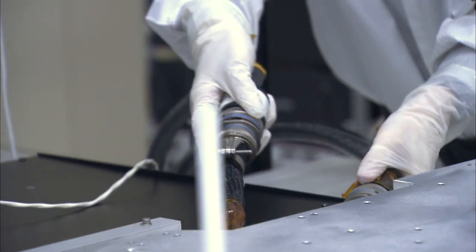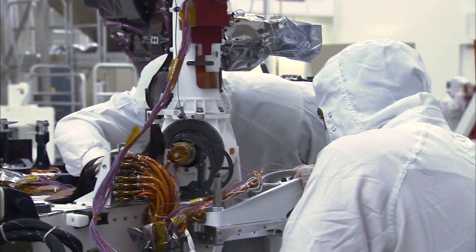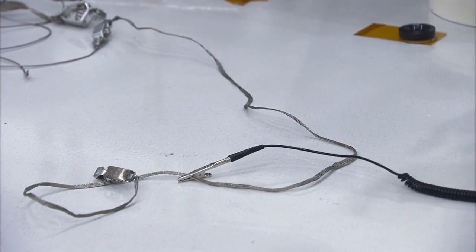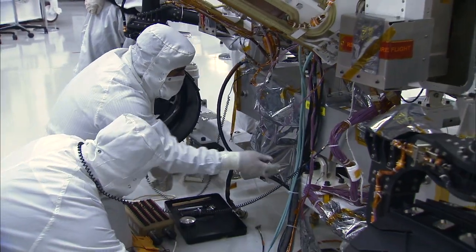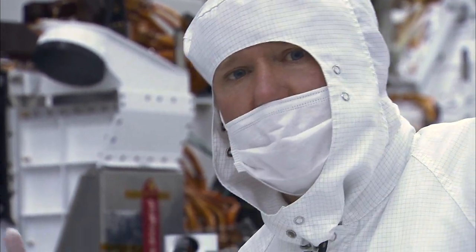Sparky means we do all the electrical integration — we verify that the connectors are made correctly, and we do all that kind of stuff. We're asked quite often why we have to hook up our wire to this ground lug. What this does is it leads off electrical charge on our body to the earth. The rover has sensitive electronics in it, so if we got close with a charge it might damage it. This just ensures that we're down to a zero charge when we work on the rover.